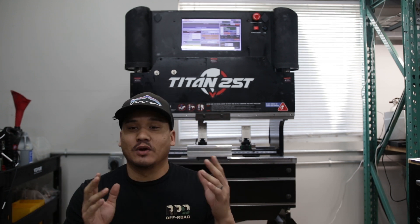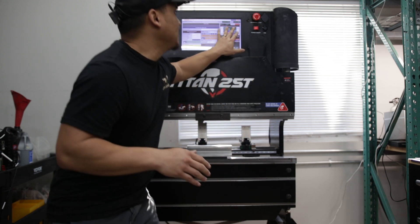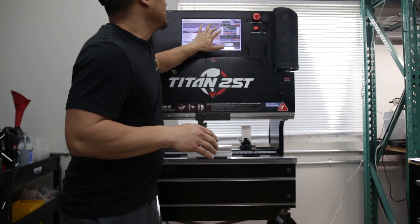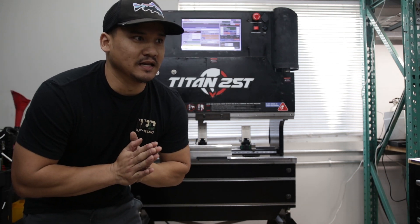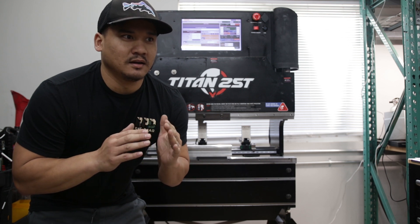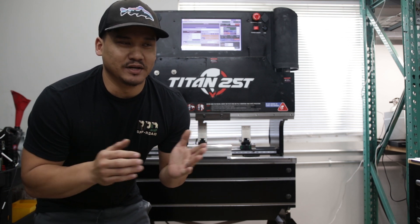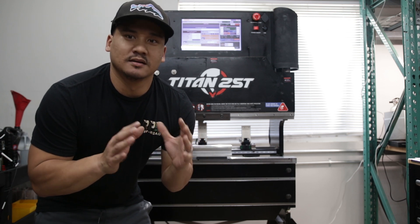What's up guys, Rodz here. I'm going to show you how to check the RAM-to-table opening on your Langmuir press brake. When you go into your settings you can input the correct value, and what that does is give you better control over your overbend and underbend, so you're not having to put like five degrees or some crazy number — you should be within three degrees.